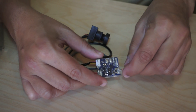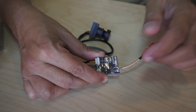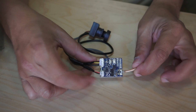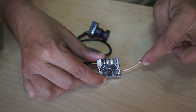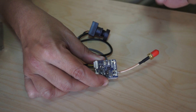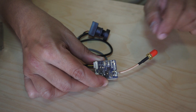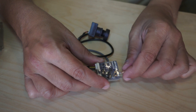The antennas that are soldered directly onto the video transmitter sometimes upon crashing break the antenna connectors right here, and then the whole video transmitter becomes useless. This is a very nice feature — they have given us a flexible coax cable so you can fit your antenna somewhere else. If anything goes wrong in a crash, at least your antenna will break but your video transmitter will not be damaged.